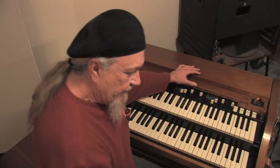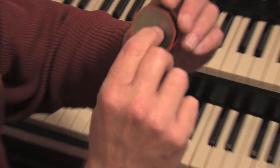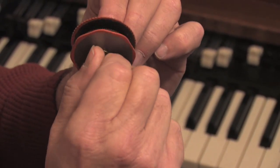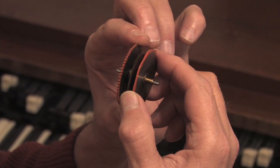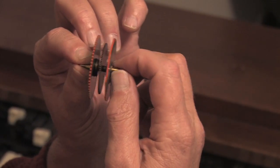There's a tone wheel generator that has a bunch of little tone wheels in it, and I think there's one laying right there with that coffee cup. Will, if you'll hand it to me, I'll show you. In a Hammond organ there are 96 of these tone wheels. They're built into a chassis and they all turn at the same speed once the motors run, but they're all shaped differently — they have different sized magnets that create different voltages, and that's why you hear all these magnificent tones that come out of one of these things.